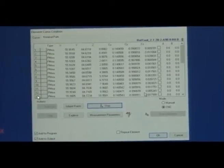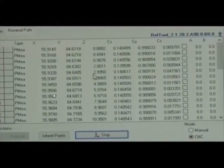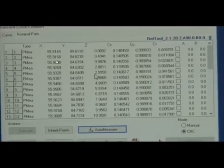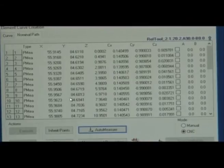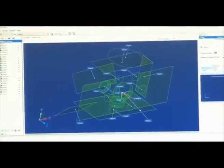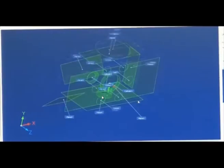The machine has generated points — perhaps 30 or more — located at each 1 mm distance. This is how the auto-measure CNC mode of the machine works. We have generated the features. This was a structured point cloud, and we can generate a triangular mesh from it. The next step is alignment of these shapes to generate the overall 3D shape.